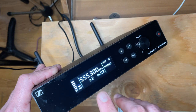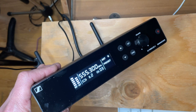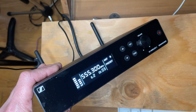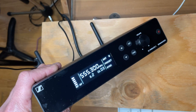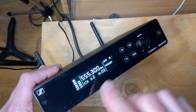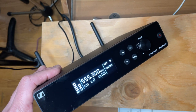I'm coming back to my bank two, channel three settings so you can always hear the audio. There is a way to synchronize the microphone — there's a button on the end of the mic, and when you push it the sync function lights up right underneath the word 'preset.' When the sync light is on and I push this button, whatever assignment is here on the receiver will be sent to the microphone so it lines up right away — a quick setup for someone who takes a few minutes to learn how to use the unit.